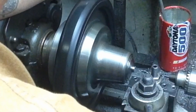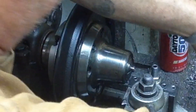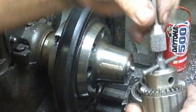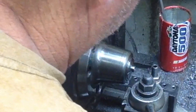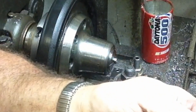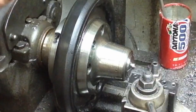You can drill all the way through because of the stop in the back. Now all that's left is to tap it. I actually take another drill chuck that I'm not using right now and open it up to that diameter so it accepts the back of my small tap wrench. So all that's left on this is to tap it, and I'll have to flip them around and deburr them - probably deburr both ends a little bit. This is what you end up with - you part it just like that. This end has to be deburred yet and countersunk slightly, but that's what it is. I'm going to tap this off camera because I can't reach around there, but that's the general setup - quick and easy.